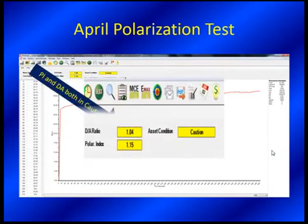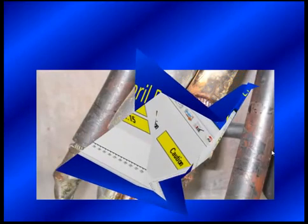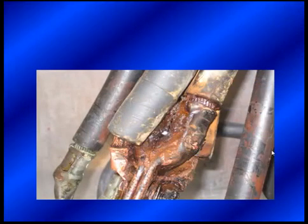As suspected, when water is in play, you expect to see these low values of resistance to ground on the vertical axis — flat as it can be and way under the 2 PI value. Often the next step is to go down to the motor and break apart the motor and the power circuit to verify where the issue is at. Like in war — divide and conquer. Separate things and see where the root cause is. Lo and behold, we go down to the motor circuit and find this in front of us.